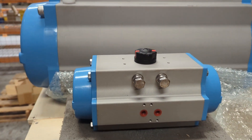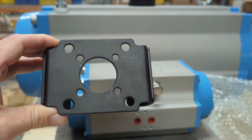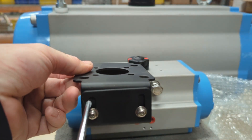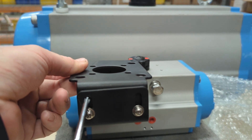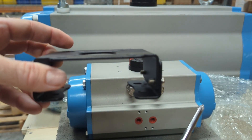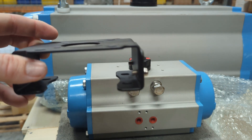What this bracket will allow you to do is span a couple of sizes. You can see the mounting holes on the top — we've got multiple. On the side you can see these are slotted — see that there? So you can move this foot of the bracket up and down. You can also invert this foot so it will face out, giving you a wider mounting. So you can adjust the height and you can have two widths on the bracket.